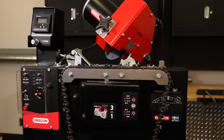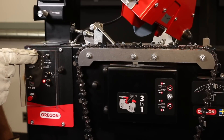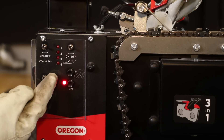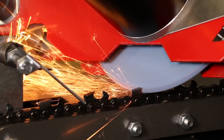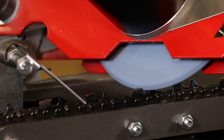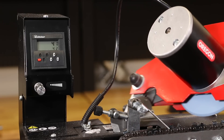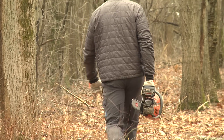Check to make sure the 3-in-1 feature, grinder motor, and chain pusher switch are all active. If you don't want to set the depth gauges and clean the gullets, simply deactivate the 3-in-1 feature. The Oregon Automatic Chain Grinder will finish grinding the chain without any assistance. Once all the cutters in the loop are sharpened, the machine will stop automatically. Now the newly sharpened chain is ready to get back to work.